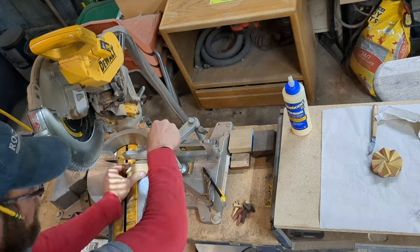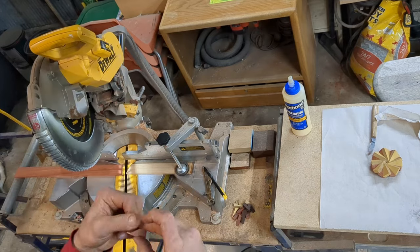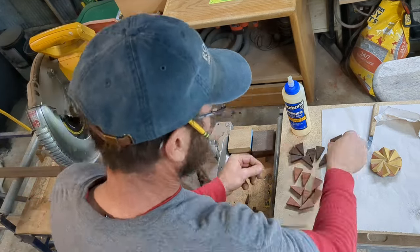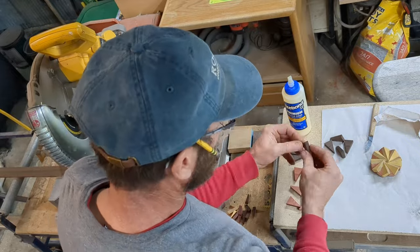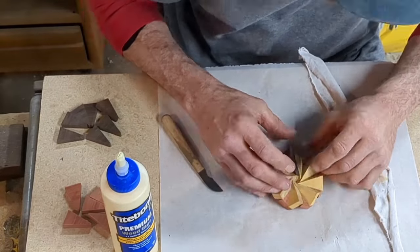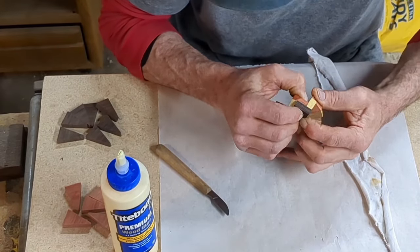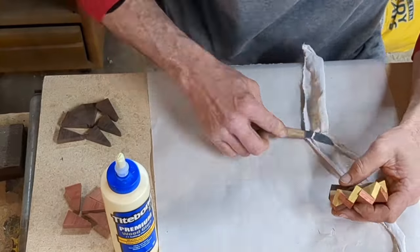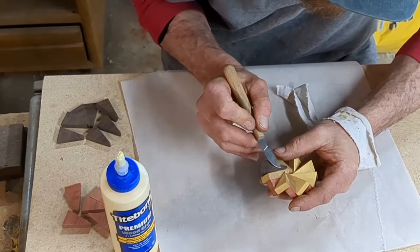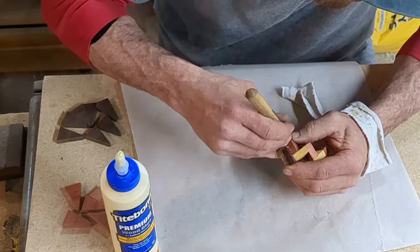Foundation met those requirements, so let's increase our stock just a little bit, moving from a triangle to an isosceles trapezoid, and giving us a little bit of a pitch to our vessel. Inspection for blade wobble and what have you. Sometimes it takes a little bit of sanding. Here our segment will be hanging over slightly to the outside. You saw I checked my lap joint first thing to make sure it's flush all the way in and out. And of course, glue removal. This isn't really important on the outside, but I just like it to look pretty.